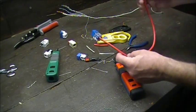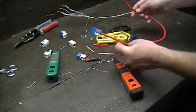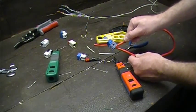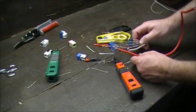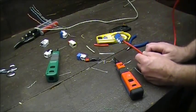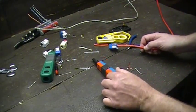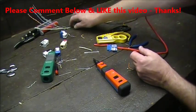When you put the cable into the jack, I want to see at least this much cable — enough that if you have to take the faceplate off later you can still service it. If you've got a sloppy install with a lot of cable hanging out and string coming out, an electrician coming in to put an outlet nearby can affect it. Punch-down tool: one side is the cutter. Different jackets, different colors.